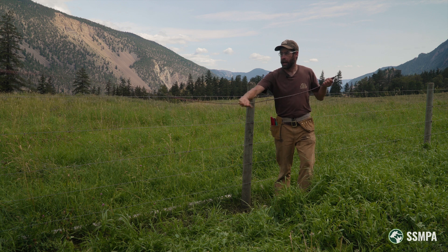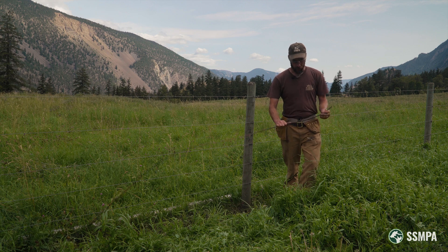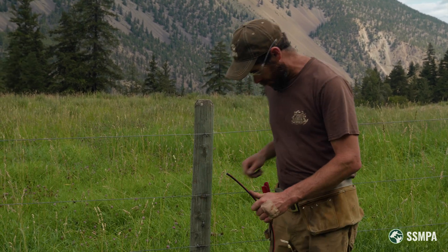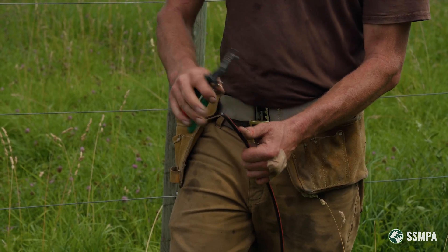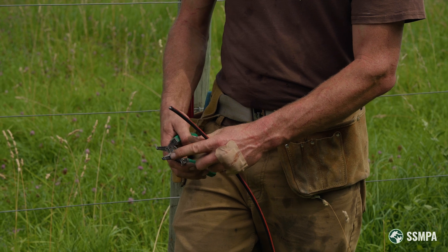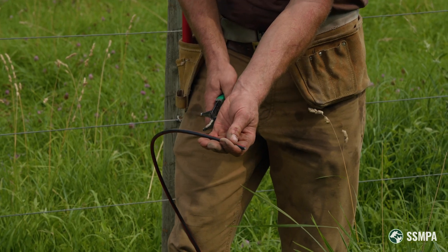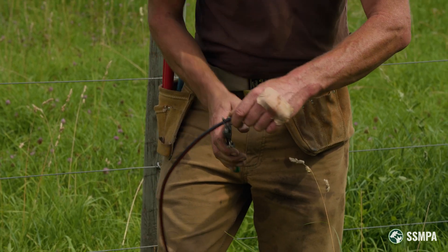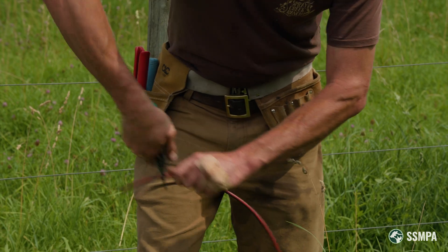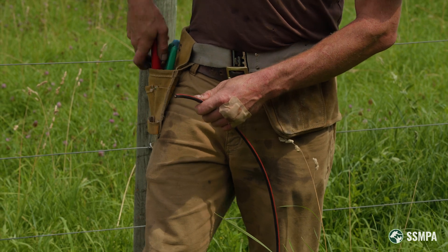Here I've got my high-conductivity lead-out cable — galvanized steel with an aluminum coating. I like working with this one because it's a little more flexible than some of the other lead-out cables that can be pretty stiff. There's no super easy way to strip this stuff — it's pretty tough — but it is about 12-gauge wire inside. Your regular household wire strippers with the 12 or 10 gauge space will do it. I like to do it about four fingers back from the end and clip around it a couple of times to get through that thick jacket, then rotate it just like stripping a normal wire. The tricky part is getting it off.